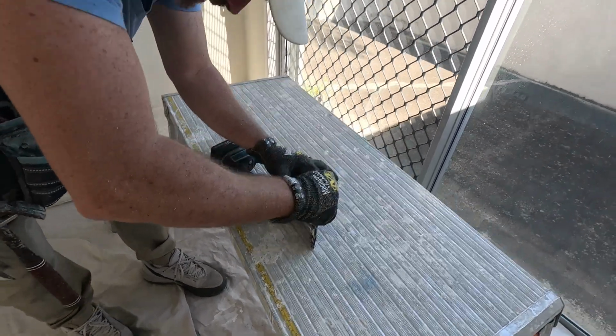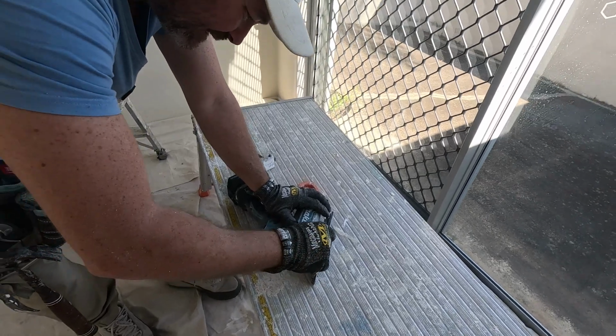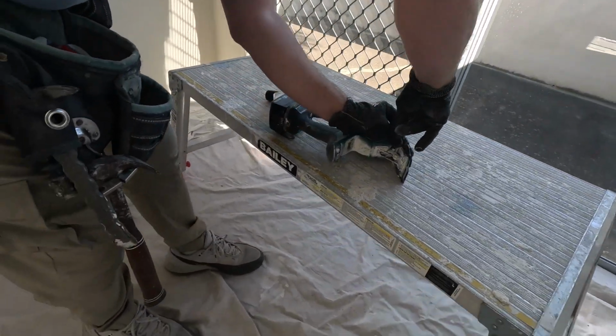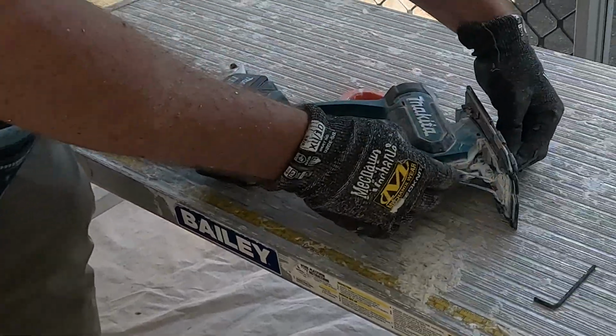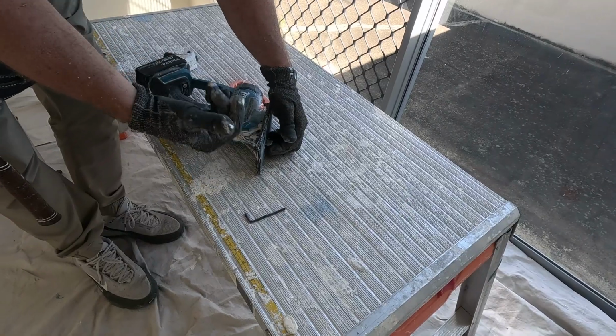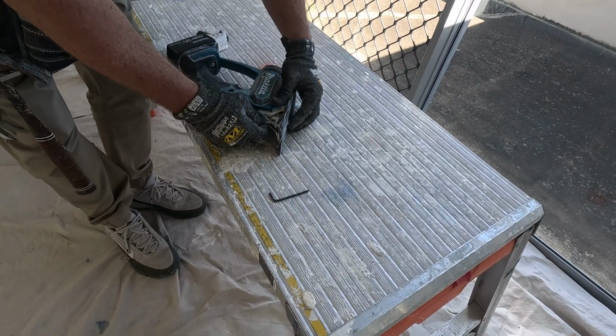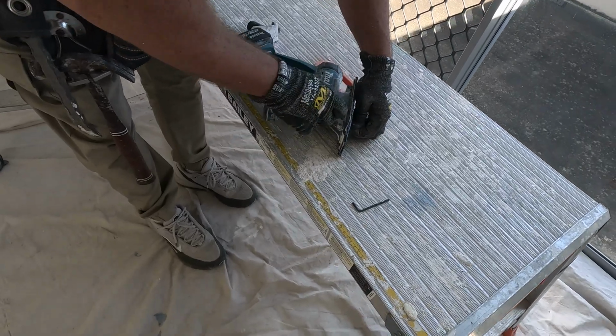All right. Sometimes these can gather a lot of dust and it can start to slip, so it's a good idea to clean them out every now and then. Just loosen them up, and then the blade can sort of move up and down. If you want to take it all the way out, loosen the screws all the way out and just pull it out.